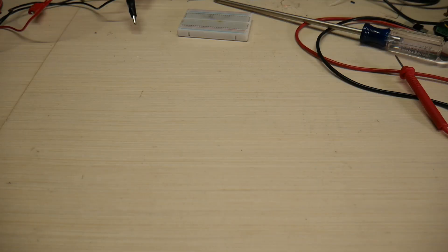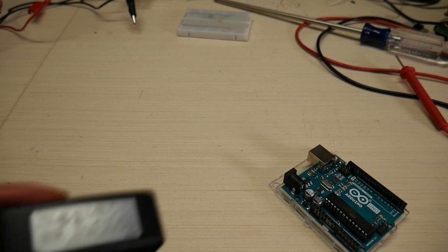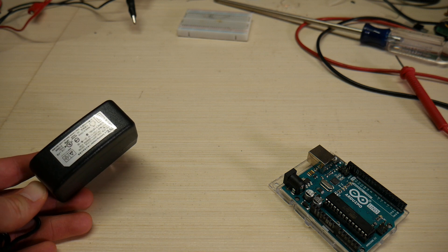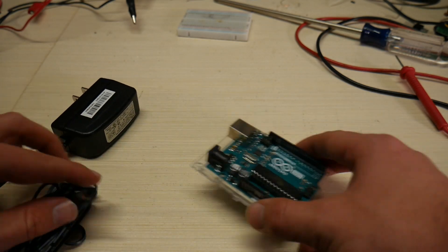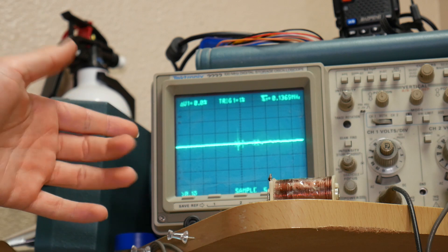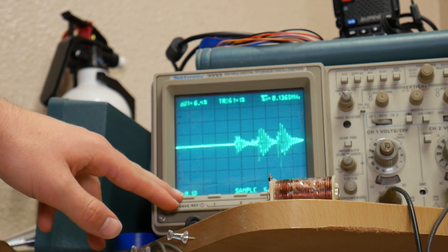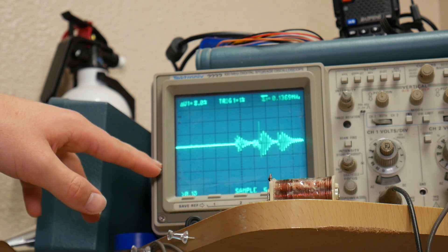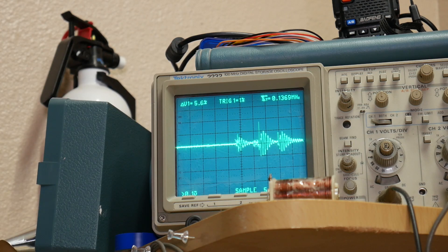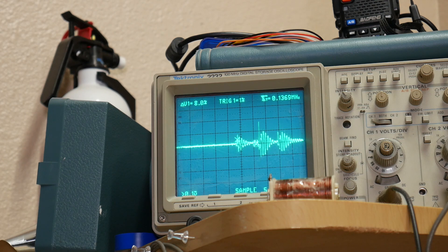This brings me to the main point of the video: what power supply to use for your own project? This really depends on how you're powering your project — whether from the wall or a battery — how much current your project draws, or how susceptible it is to electronic noise. For the most part, if you're just using a small project that doesn't draw too much current, one of these wall wart switching adapters works great. For an Arduino, it's light and simple. One thing to be aware of with a small switching power supply is electrical noise, especially if you're doing any project sensitive to noise like audio or some digital circuits. This noise from a small wall wart switching supply hooked to my oscilloscope is peaking at around 0.1 volts or even higher, which isn't good. This can be somewhat fixed using low-pass filters like an inductive choke, but it's still a problem common with switching power supplies and not with linear power supplies.